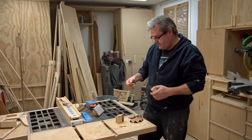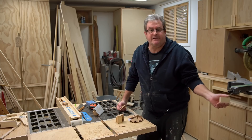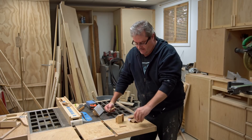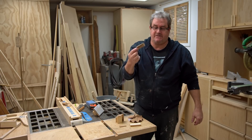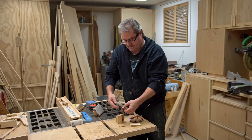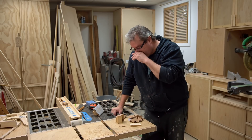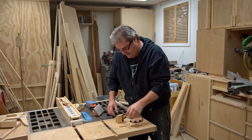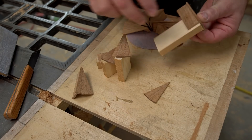I'm building these stairs and making a video for my other channel, my main channel, showing this build. I thought this might be interesting to show how I'm going to be putting them together. I spent about three hours yesterday just cutting out the step sections right here, and as you can see they're not very big. They have to be glued together so they form the spiral going up, and to do that accurately is very difficult. I came up with an idea to cut progressively taller blocks, and the blocks will support each step.